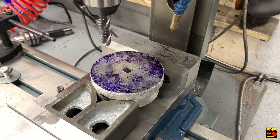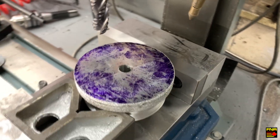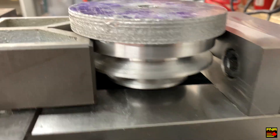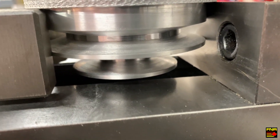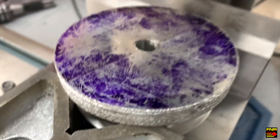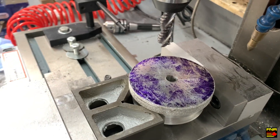Sometimes I'm so smart I outsmart myself. What I was doing here was making this pulley, which is going to wind up being the drive pulley for the treadmill conversion on this very mill. With those grooves cut, there was actually no place to get a hold of it on the lathe chuck — at least not very well. And when I have to hog off all this material, I just didn't trust it to stay in the chuck. So what we're going to do is mill it off.